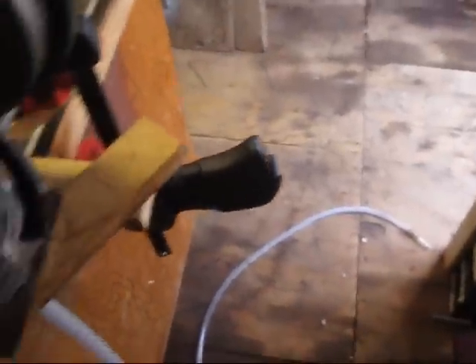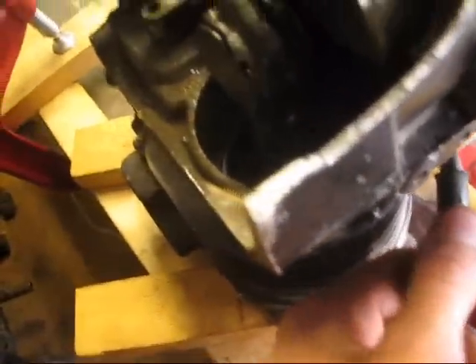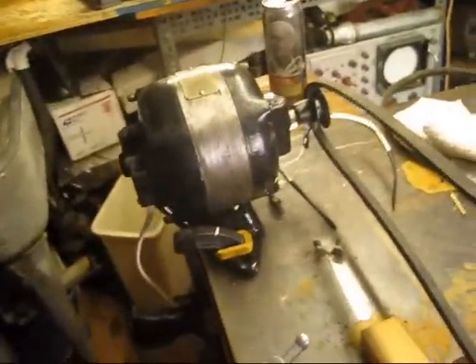I made this base for it — just a metal plate. Underneath I've got an air compressor fitting hammered into it, then that goes to this hose. At the end I'm going to make up a check valve system — basically a T, where one end is a one-way check valve for intake and the other is one-way for output. Right now it's just hooked up to the piston so it sucks and blows alternately. I've got it belted to my restored GE electric motor, and I'll plug it in so you can see it working.